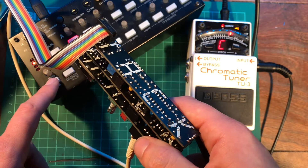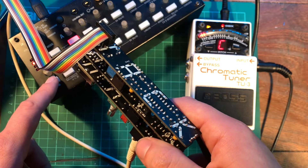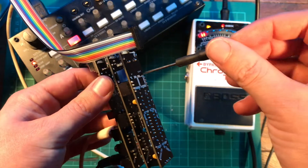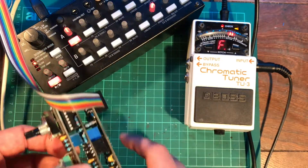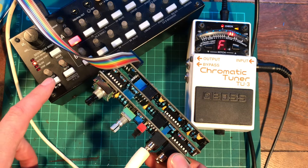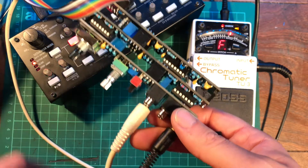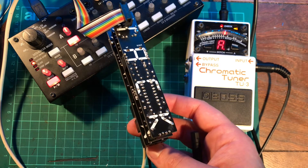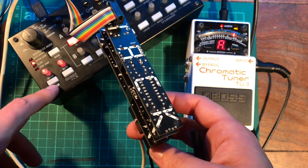Now I've narrowed down on it a bit more and I'm switching between the octaves. You can see it's within the range of a C note. If I switch between 0 volts and 1 volt, it's not moving on the tuner, which means they're exactly an octave apart. Now that we're pretty close with the octave interval between 0 and 1 volts, let's set it between 0 and 2 volts to get a bit more of an accurate measurement, just because the intervals are further apart.